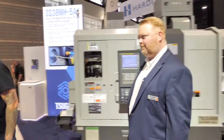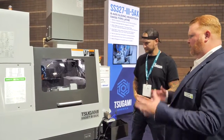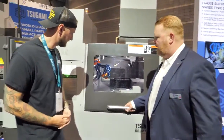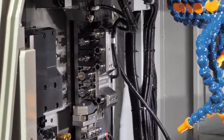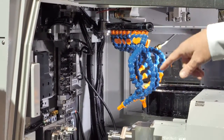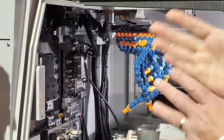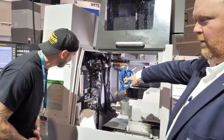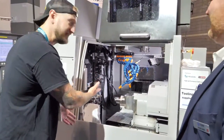Let's go look at this last machine. This is the SS-327-3 5-axis — a more conventional CNC sliding headstock Swiss machine with 32-millimeter capacity. What makes it special is the B-axis. We have a compact Swiss machine with dual gang plates, but on the rear gang there are four live tools mounted on a swiveling B-axis that can be used at any angle. The B-axis is a full trunnion setup — servo motor on top, braking mechanism to hold the angle for fixed-angle work, and a lower support at the bottom — giving best rigidity. This is mind-blowing.